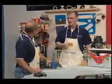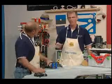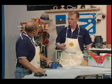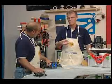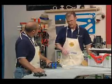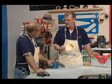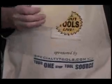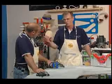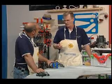It actually pioneered an art in sanding that didn't really exist before, and that was extremely efficient removal of debris and dust and media from the surface while sanding. And it did it really by the presence of the perforations throughout the pad, instead of just having holes on the perimeter, which had to allow for the dust to migrate across the whole surface, finally get to a hole and then disappear. Right. So it kept your paper from having uniform contact with the surface.